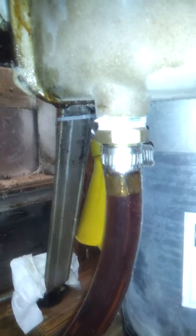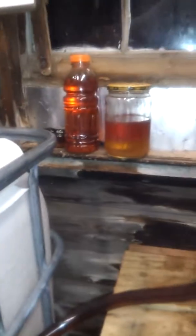The oil is coming out down here — you can see it running right now. It kind of loops around down here to keep a lower loop. It's really important to keep the air from the centrifuge from blowing the oil out and making it splash. The only place I want air moving is going out here and coming in here to keep the condensation going on its way out, and that vents right through the outside. You can't really see the mist out through the windows, but it's there.